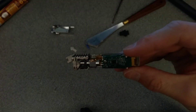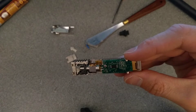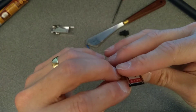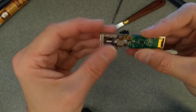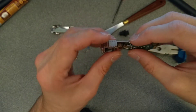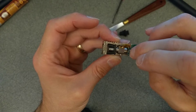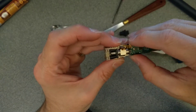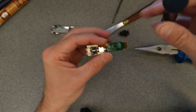So here is the optic. You've got the contacts — let's see if they're double-sided, we'll find out in a minute. You have what looks like a guide or a clamp for the SC connector here, this black plastic bit. And the receiver and transmitter. I'm going to assume the one with the bigger wires will be the transmitter, because that probably uses more power than the receiver, which I expect is this little ribbon cable there. Let's see if we can unscrew this.